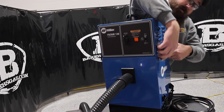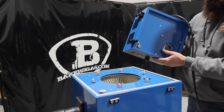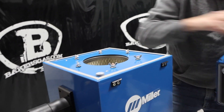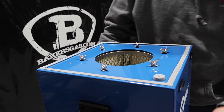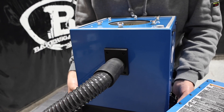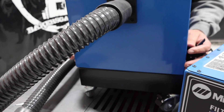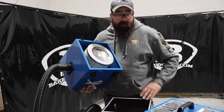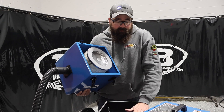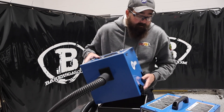On the side you can see two turnbuckles here, two on this side, and those come off and then the top just comes right out. There's the motor — everything is right there. And here's your filter box. I take that off because that is probably the heaviest part. Your filter's down in there, and then you pop these two out. That's how your filter comes out — out the bottom. This is your dust collection tray. They all have nice seals around there, so when it's in that high vac stage it actually suctions itself together and performs a nice tight seal. All your heavy particulates come to the bottom and then it filters all the fumes out with that filter.